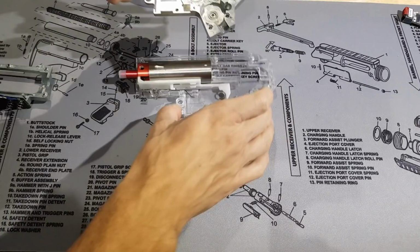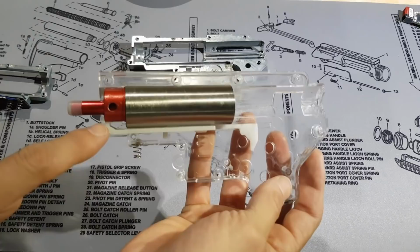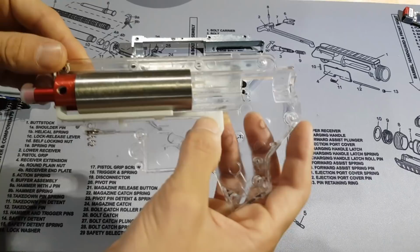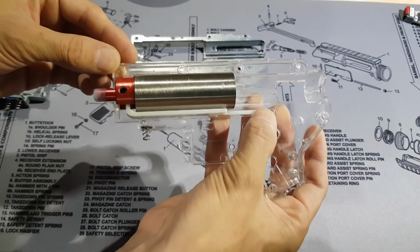And there is an easier way to do this. I could just get the Dremel out and take this little corner piece off here, but I don't want to weaken the structure of the tappet plate, so I'm not going to do that. So here's the thing, right? Watch the tappet plate here. I can bring this tappet plate all the way back to the front of the cylinder there. Nice. Full movement. Full range of motion. I think it was like 10 or 11 millimeters.